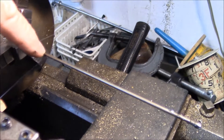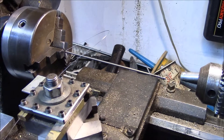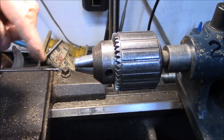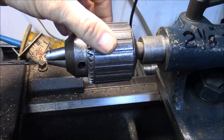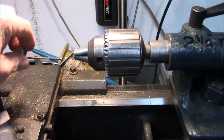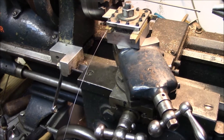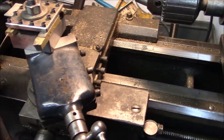The mandrel will wobble a little bit as the chuck turns, but that doesn't really matter because I'm just winding the wire around it. The other end of the mandrel I'm going to hold in place using the tailstock chuck - I've greased the end and will tighten the tailstock chuck just enough to support the rod but still let it turn. Now I'll turn on the lathe and check my feed on the carriage.